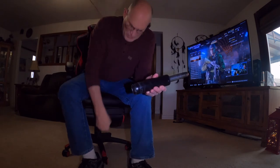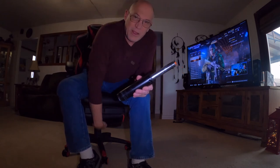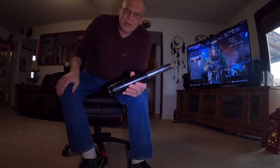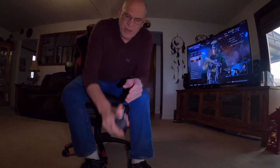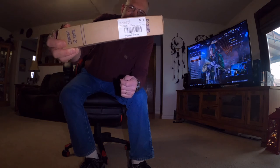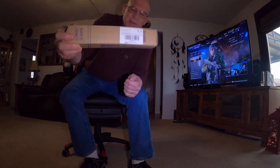Important thing to remember: measure where your chair comes in at the top and at the bottom of the chair. Get your length right and get your throw - it's in the descriptions. Most chairs are 2 inch and 1.1 inch. The gas piston I got was from Oakleaf off of Amazon for less than 30 bucks. I'll put a link to it in the video description. There are quite a few out there - I've been pretty happy with that brand. This is my first repair so I'm hoping over time the piston will do a good job. See you again.